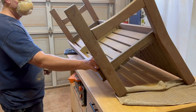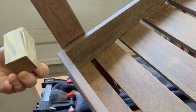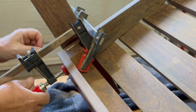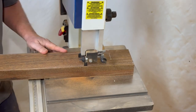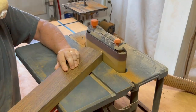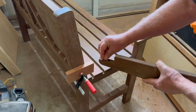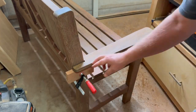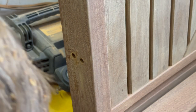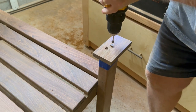These joints on the front corners will carry a lot of weight as well as some shear stress. Some people put corbels here to stabilize the bench. I'm thinking a cleaner design is nice and I believe that just gluing in some beefy blocks should give enough strength. I'm using double sided tape to stick both arms together so that I can cut and shape them both at the same time. One last use of the dowel jig on this project, then I use the dowel alignment pins to mark the matching holes on the frame.